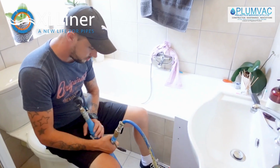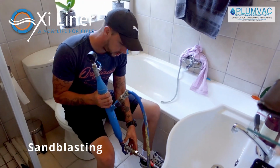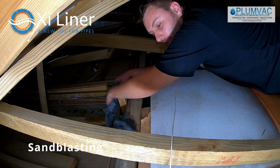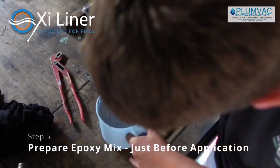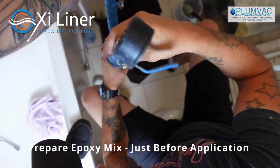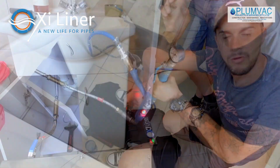Are you ready? I'm ready. I'm going to pressurize the tube and we're going to open this. Good, it's all here. Once it's sandblasted, you go and mix your potable epoxy. Pour your epoxy in and repeat the same process again. At 8 bar, you blow the epoxy through, and it'll then come out in the roof.